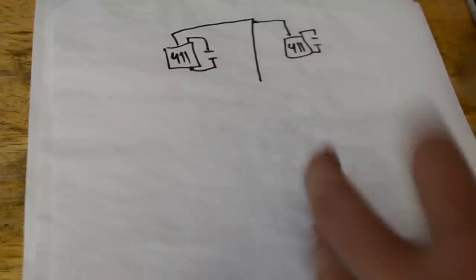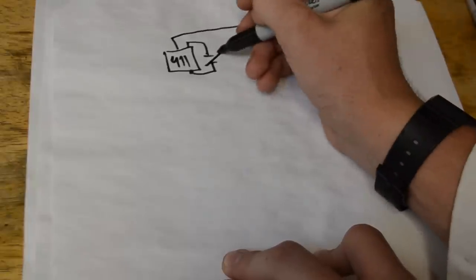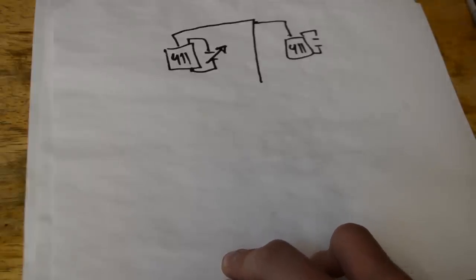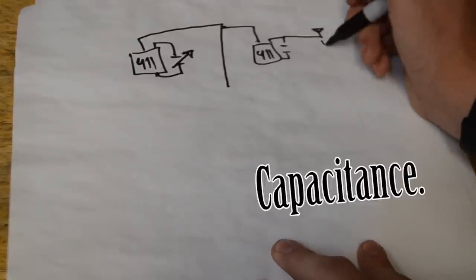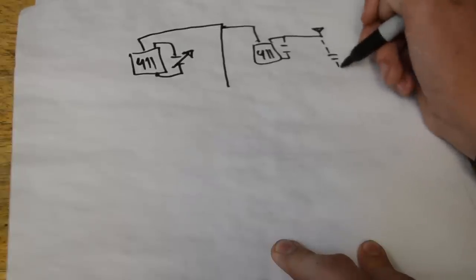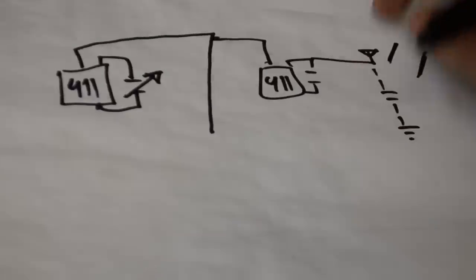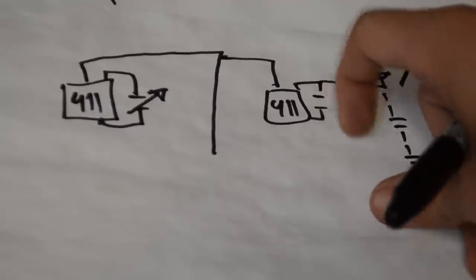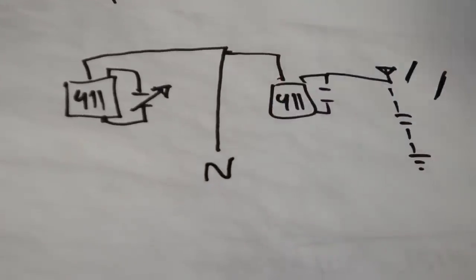We're combining these two oscillation frequencies, and ideally when we have nothing it would be net zero. We have a variable capacitor just because we'll be able to tune it, since depending on different environments the capacitance rates will change. On the right side we have our antenna. What the antenna does is create a pseudo-capacitance between you and ground, since the whole circuit is connected up to ground. The capacitance generated between the antenna — which counts as one side of the capacitor — and you, which counts as the other side, is going to slightly vary the net capacitance, which will slightly vary the resonant frequency, which will then manifest as a frequency given out when we combine them both together.